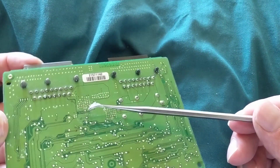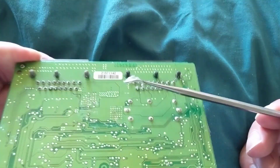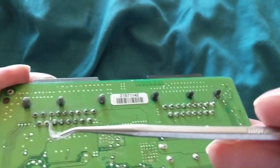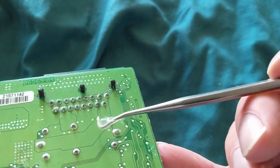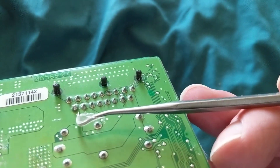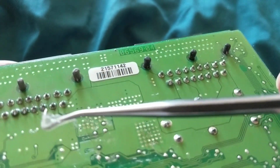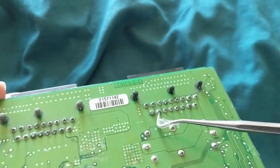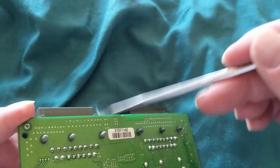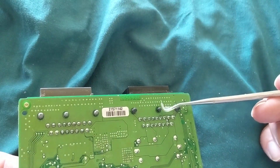Keep in mind the module is not sealed and screws are missing. When you look at the through-hole connections, which are hand soldered, you should have the proper and consistent amount of solder on all terminals. What you see here is that some terminals have much more solder than others. That was a clue for me right away - somebody was in here and tried to do rework. They always try to do rework on the connectors because they think the connectors are the guilty ones.